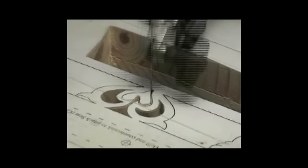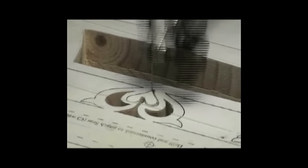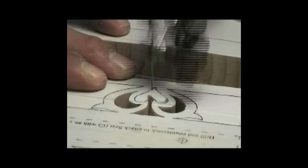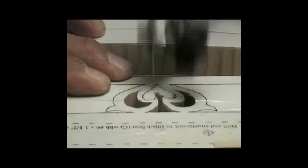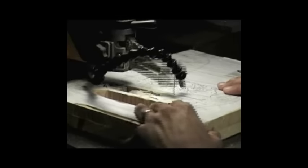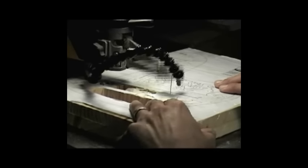Well, back to the heart of the matter. You know, it's important when doing complex inside cuts like this to thoroughly understand the pattern prior to cutting and maintain blade and pattern awareness throughout the cut. Now we're going to continue to make our inside cuts and work our way up the chair side. Remember, just don't rush it and focus on one cut at a time.